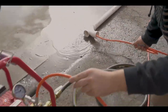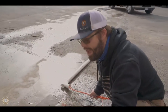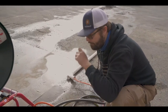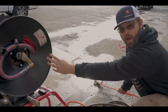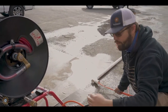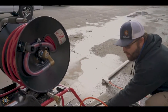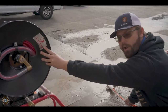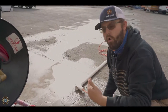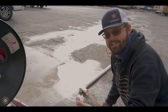When using the smaller hose and you need to change tips or change directions, you'll have to shut the whole machine down but leave the water on so the pump has water on it. If you're using the larger hose in that same situation, you can throttle the machine down to idle, then turn off just this ball valve so water is still going to the pump but not to the hose, allowing you to change the tip or change directions. Before you throttle back up, you're going to want to re-purge that system, because you've let air get back in.